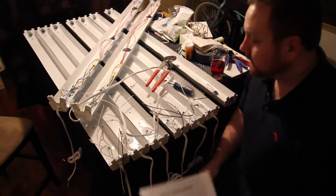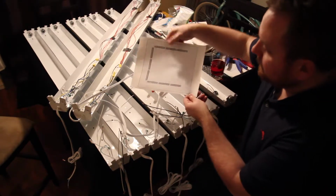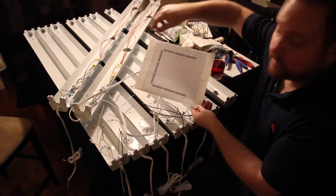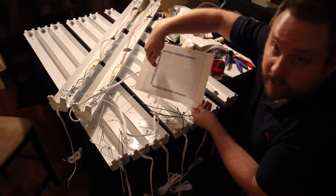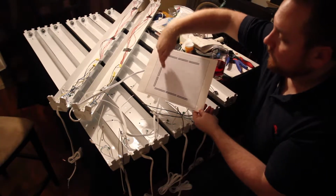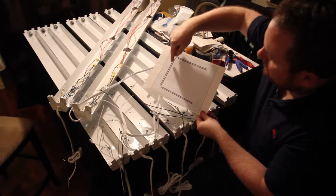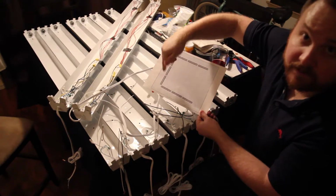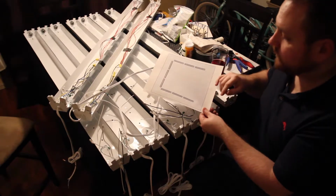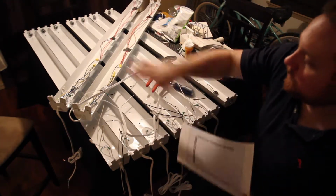So let's go ahead and take a look at the lighting setup that I plan on having in the shop. Here's a little diagram. The idea is that we're going to have a big U-shaped set of lights. There's gonna be 9 of them. All the lights are going to be daisy chained in this U-shape, starting from here in the middle. So what that means is that we're gonna have 3 different kinds of lights. We'll have the one in the middle that will branch out to both sides. We'll have all of these 6 guys here that are daisy chained. They have to have power come in and out the sides. And then the 2 guys at the end will only have to receive power from one side, and they won't have to pass it on. So that is what we've got right here.